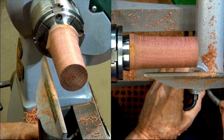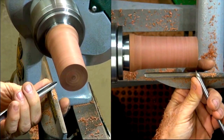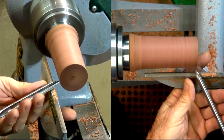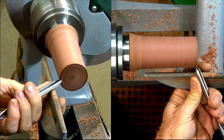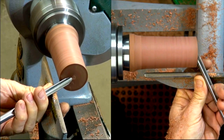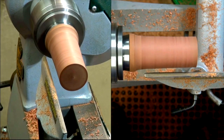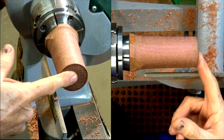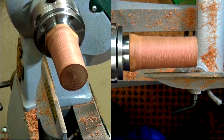I'll show you how I can make that same cut with the three-eighths inch spindle gouge. Having the bevel — that's the part that goes on the grinder — absolutely square to the wood, and coming in at dead centre, you just go in square, rotate the tool slightly, and you get a beautiful cut off the tool. There's absolutely no tear out there at all.